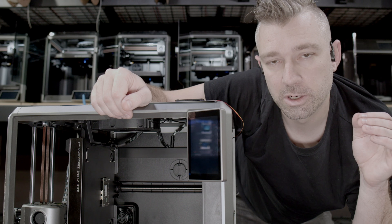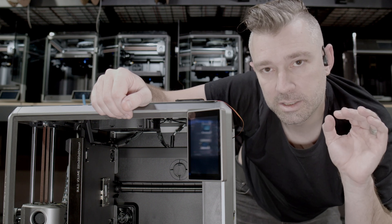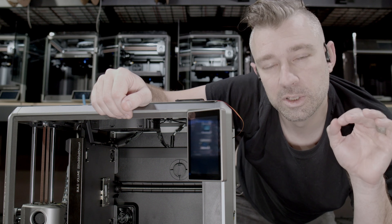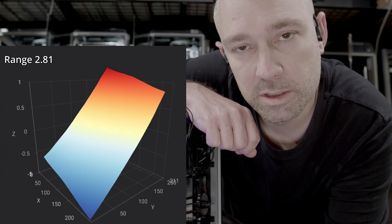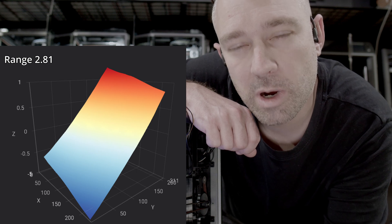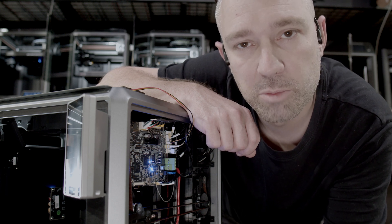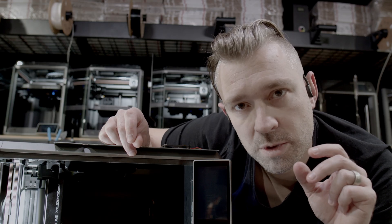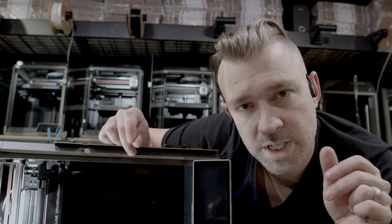At this point we can start to adjust the Z screws. We need absolute position, so we do not, under any circumstances, adjust the rear Z screw. We will only be adjusting the front two Z screws, leaving the rear Z screw to act as an absolute position. Now that we've run our bed mesh, we can see that our range is at 2.8. Keep in mind, 2.8 is far outside the requirements for auto bed leveling — you realistically want anything below 0.2, and ideally below 0.1. To raise or lower the bed, we just need to rotate the front Z screw clockwise to move up and counterclockwise to move down. For you zoomers out there: left is up, right is down.